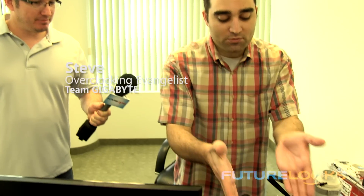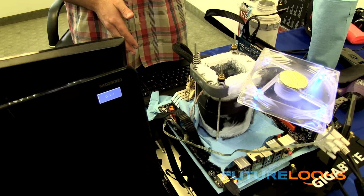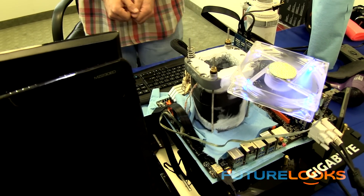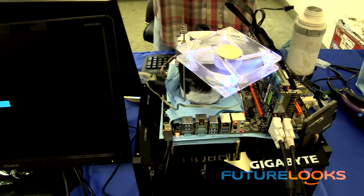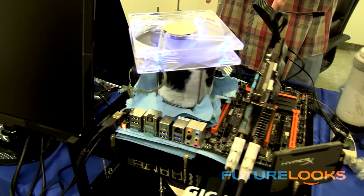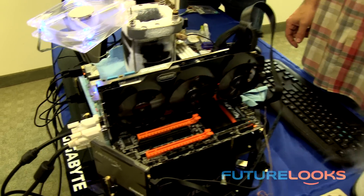You can see all this frost has formed here, but not much frost has formed on the other parts — that's because this fan keeps the airflow going. Now let's say I have a cold bug and I need to shut down. I just pressed the off button — the post code isn't on, the system is off, but the fan's still on. That is OC Ignition right here. OC Ignition keeps power going to the fan connectors, the GPU slots, and the lights on the board. I can actually leave and go take a break and come back — my fan will still be spinning, airflow will keep going, and condensation won't form around the board.